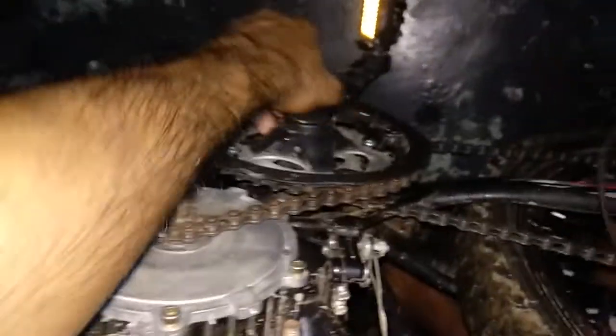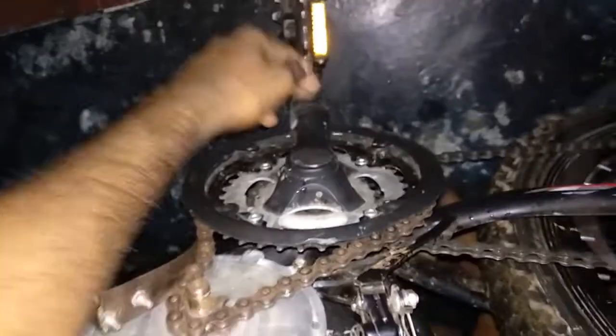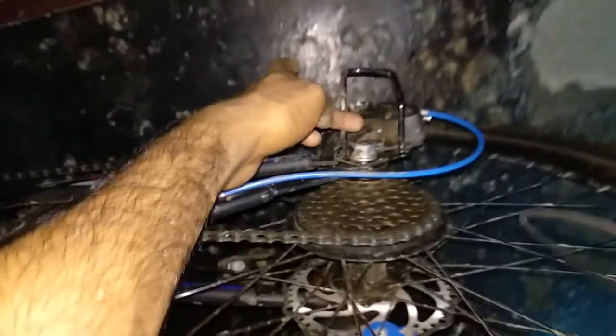In running condition I can change the gear and increase my top speed — that's why I put my motor here. You might think that by spinning the motor the crank will also spin. You're right — the motor will spin and the crank will also spin. I will solve this by taking the crank out and installing a one-way bearing or one-way sprocket, so the crank won't spin when the motor is running and I can safely rest my legs on the pedals.